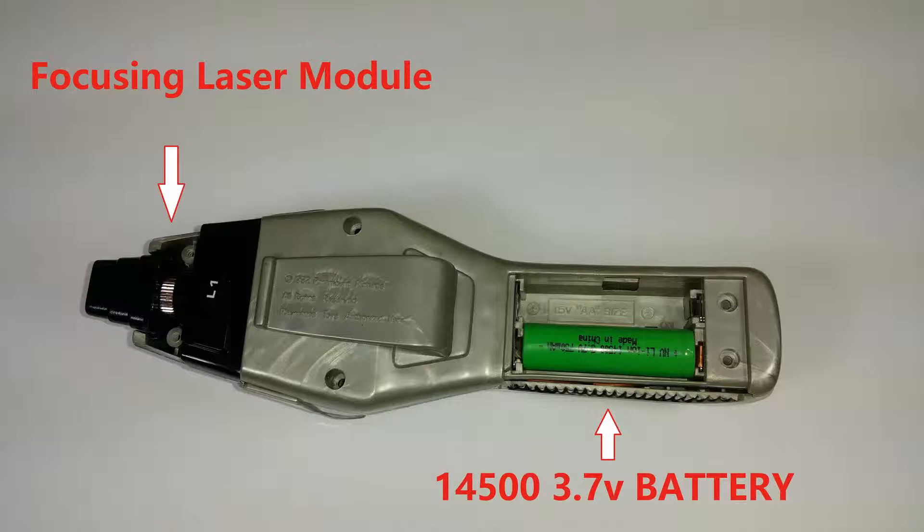It's not really that simple — we have to consider power. The two AA batteries originally used to power the phaser as a toy only produce three volts between the two of them: 1.5 volts each, wired in series, which means you're adding the 1.5 volts of one to the 1.5 volts of the second for a total of three volts. That voltage isn't enough to power the laser. Although I did get some light out of it, this 250 milliwatt laser is rated for 3.5 to 5 volts, so I need it to hit about 4 volts before it's going to do anything useful.